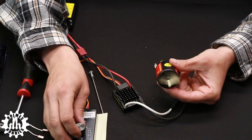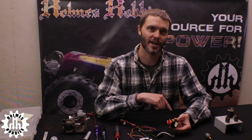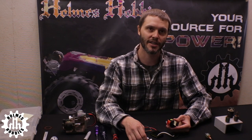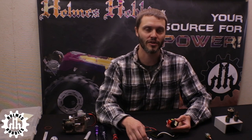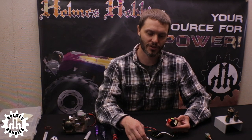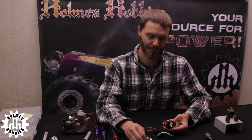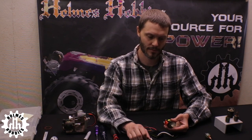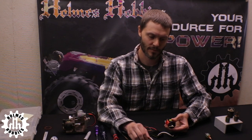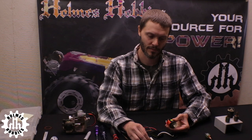We're ready to go. To ensure timing is in the proper direction, make sure forward rotation is faster than reverse rotation. You always want forward rotation to be faster than reverse, unless it's in an application needing identical performance in both directions such as a robotic situation. For most RC crawlers and trail rigs we want better brush life and slightly better performance, so we adjust the timing for a little advance. Audibly we can hear that it is faster in forwards than in reverse.